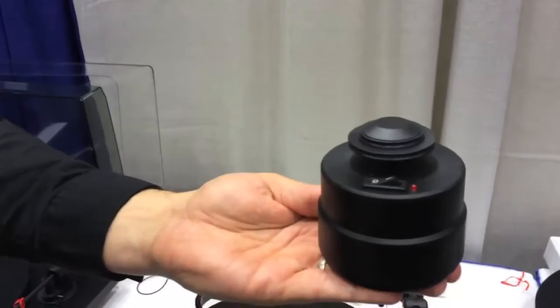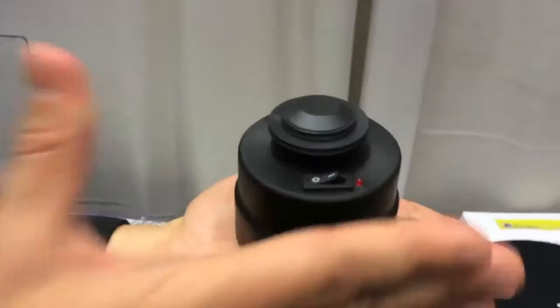That noise is what your turntable needle's going to pick up. The next thing is the motor is completely disconnected from the turntable. When you turn on a motor, it's going to vibrate. By removing the vibration from the turntable, your needle is not going to pick it up. Everything that we have done for this turntable is to reduce all extraneous vibration so that the sound you get from that vinyl is what the artist intended.